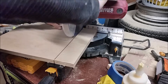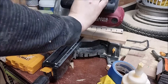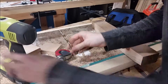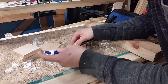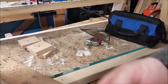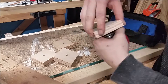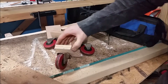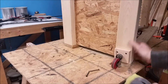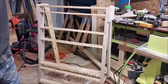Now it's time to do some wheels to make it mobile. I didn't have any bolt-on casters so I cut some hardwood plywood three by three squares to create caster bases. I found a drill bit that matched the size of my caster and drilled a hole in the center of each block. I then took a tap that was the same size and thread pitch as my caster and used my drill to thread these bases. I could then screw my caster in and use these to anchor to the box. I wouldn't have had to do this if I just bought bolt-ons, but I found these in the dumpster. I then attached all four casters to the bottom, and I could also change them out if needed.